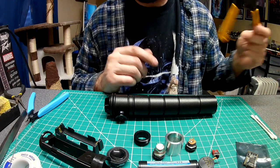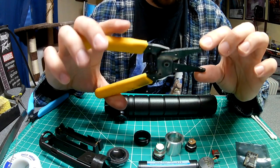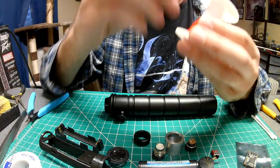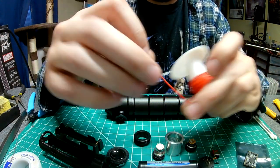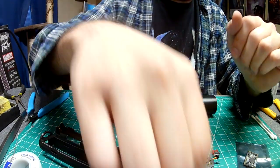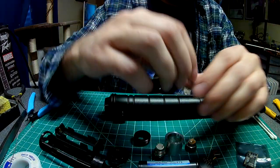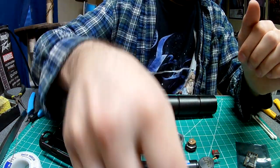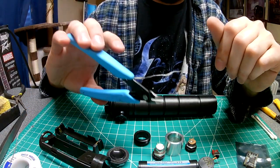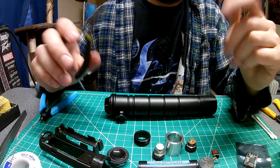I have a pair of wire strippers that go down to 32 gauge and up to 22 gauge — 22 gauge is the biggest wire I ever use, and it's still pretty small. When you're dealing with lightsabers, you need all the room you can get. I have some 2mm heat shrink, a hex wrench (5/64) for the 8-32 set screws, wire snips for tight spaces, and needle nose pliers also for tight spaces.